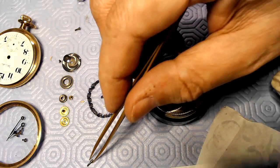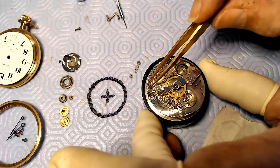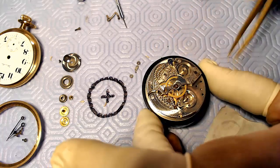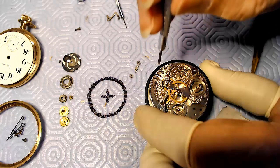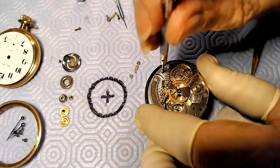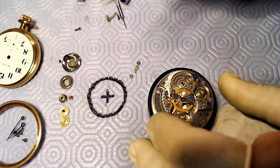And the last screw here, I just pick the screw up like that, turn the screwdriver around. It's one of the first talents you learn when you're working with watch repair, is how to pick up a screw. Usually when I put them in the plate, I just rock them back and forth till they find center, and then do that. I'm hoping I haven't missed anything. Again, with the camera right over the top here, it's interesting. It is what I would call interesting. So there's that, and that.